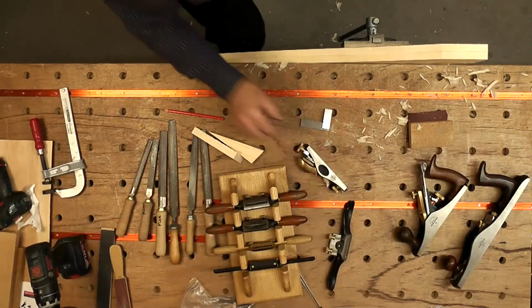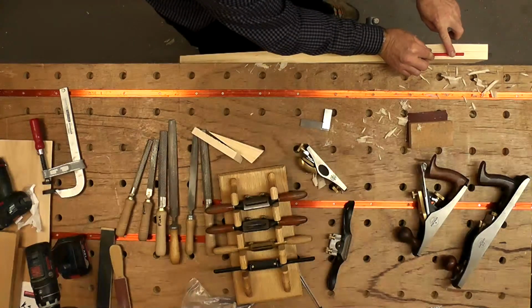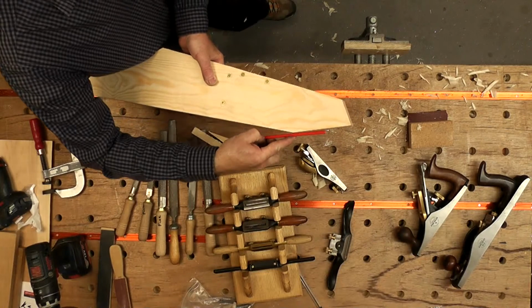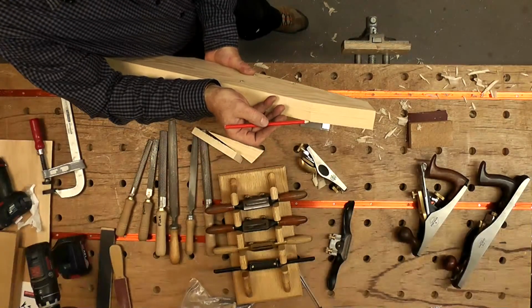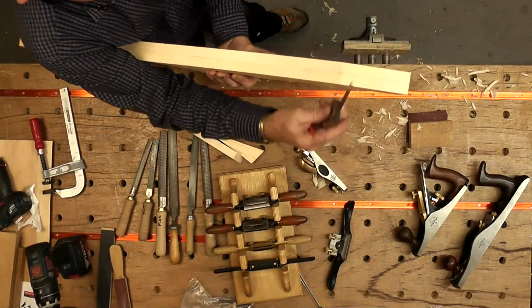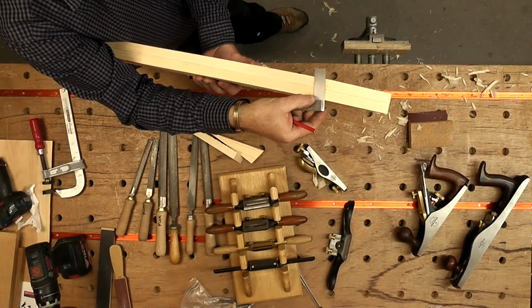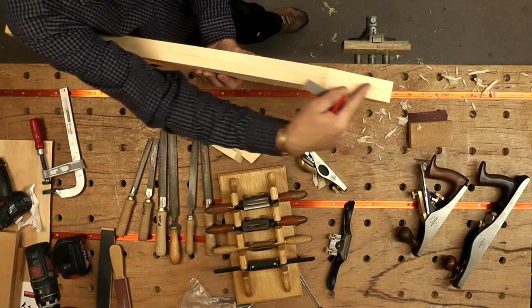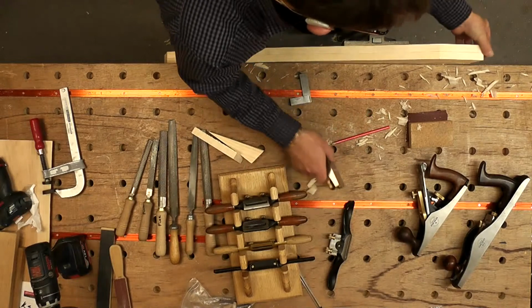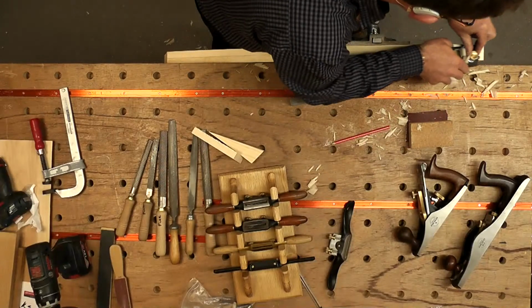Another good thing you can start to do, I think we can probably see it, here you've got a shoulder line. So in other words, fingers drop down, that tilt aspect of where the cut is. Let's just flip that over so you can see it. So you get that angle. If I look at the shoulder line here and judge, does it look square? How clean does that look? I can judge pretty much by how square I'm getting down through here, because if we take more off one side, the line will tilt back more. So just a quick visual look, to see if this looks parallel, will tell me how square I look. Quite a simple one to do. And with this being what it is of the chair, this bit sits on the floor actually. It's not that critical, it's dead square. Nice and clean. Just clean it up.